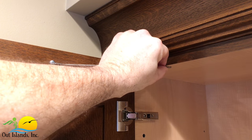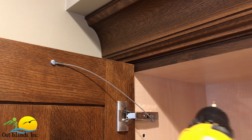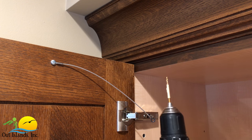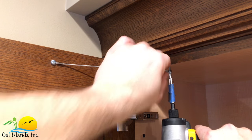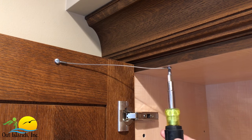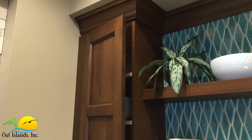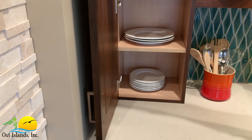Next we'll mark the location for the second hole, so grab the other end of the cable and hold it tight and using the sharpie mark the location for the next hole. Now drill the second hole and screw the other end of the restraint to the cabinet. Again, it's important not to screw this down too tight — it has to be loose enough to allow the restraint to pivot out of the way when the door is opened and closed. We're finished with the installation of cabinet restraint number two. Here you can see how the door opens and closes and the restraint folds out of the way nicely, and now the door handle doesn't hit the wall when it's opened.